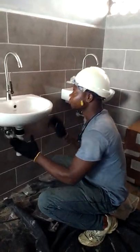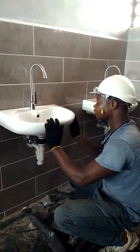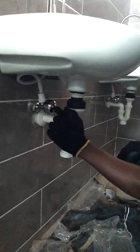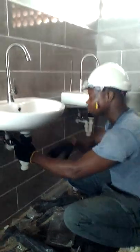What we have just done is install the washroom basin itself, the tap — a long neck tap — and also a utility trap under it. We have installed the flexible connectors attached to the tap, and have also attached it to the angle valve that connects water directly from the wall.